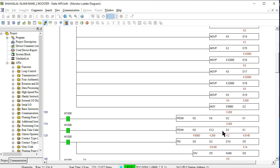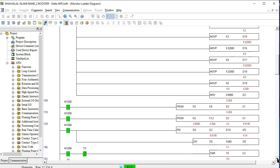So this is our suction line pressure. When suction pressure is increasing, our frequency will be decreasing. That means the motor or pump slows down step by step. This is the balancing position, which is set in our fixed positions of 4 to 16: 16 is our maximum and 4 is our minimum pressure. This is our suction line pressure, which is the pressure created by water flow.